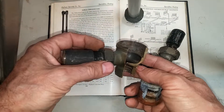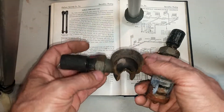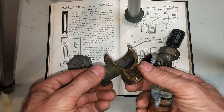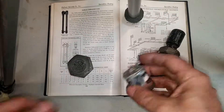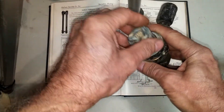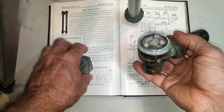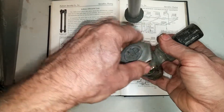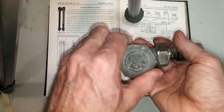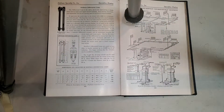By the early 1930s, this is pretty much come and gone. I don't think it worked out very well for them, and yet there are still a lot of them out there. If you see a number eight as a line trap, it's probably better to replace it with a much more modern and rebuildable trap. And that is what we have for you today.